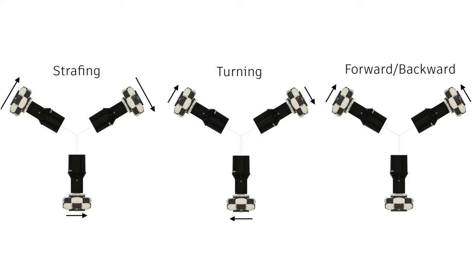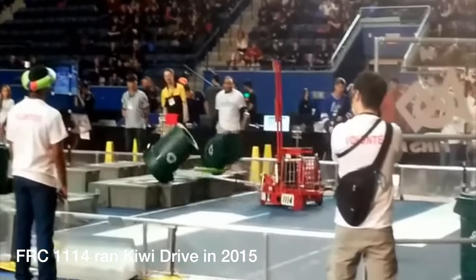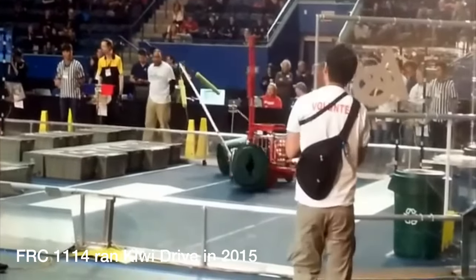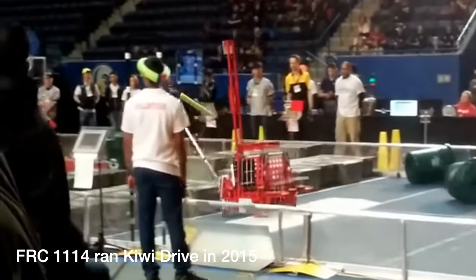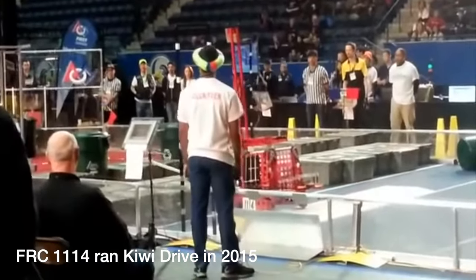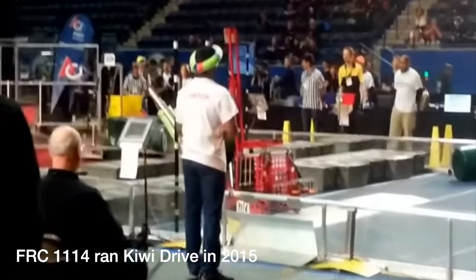Fewer wheels means less weight and less complexity in theory, but this is often offset by requiring a uniquely constructed frame to handle the odd angles the wheels are placed at, as well as heavy restrictions on the rest of the robot's construction. Available space that's not taken up by those wheels is made up of unusual non-rectangular shapes, which common components like a battery don't fit nicely in. X-Drive is the 4-wheel variant, but has little advantages over the most common last option for us, which is Mecanum Drive.